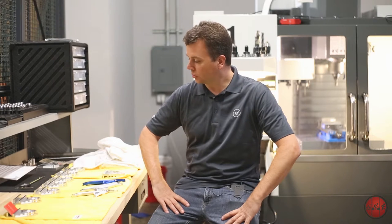Well, earlier we were showing you the 3D printer. It's a great tool for actually printing out parts because it's very easy. Like I said, you hit print and it makes the parts out of plastic. But unfortunately, plastic isn't structural for a lot of applications. So when we're talking about suspension design, you actually have to prototype into aluminum. So if we're working on a new suspension bike, again, everything's done in 3D CAD. So we're able to take those models and very quickly prototype and make new ones.